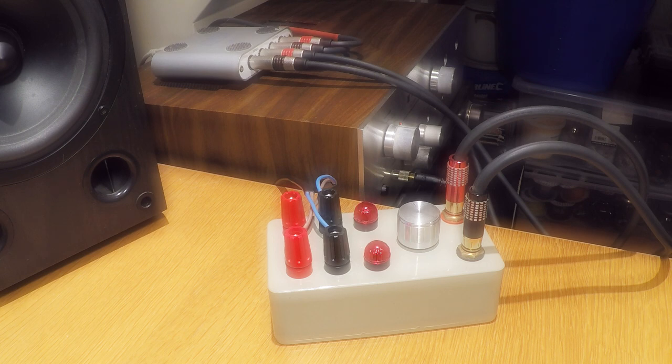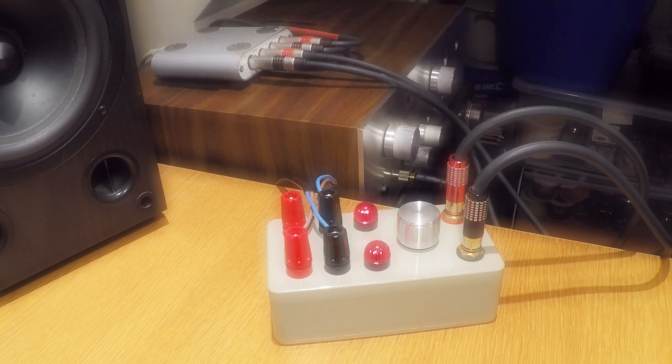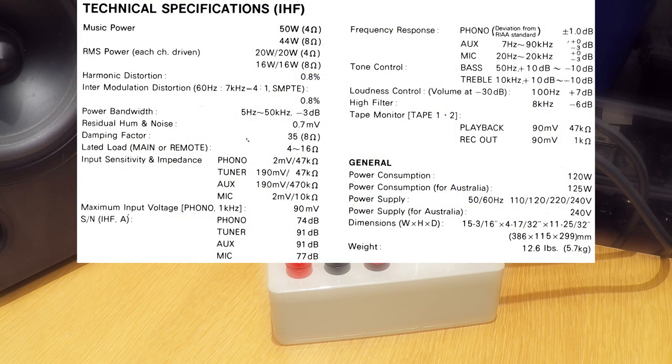So firstly, you'll need a suitable amplifier to drive the compressor. As it's passive, the compressor needs quite a high input level of 7.5 volts RMS to drive the compressor to its maximum input level at a considerable drive current. What we're looking for here is any power amplifier that's capable of driving 15 watts or more into 8 ohms and doesn't use a Class D topology.